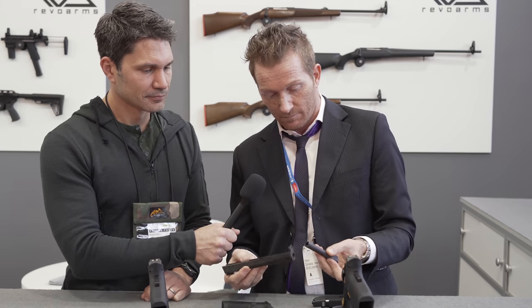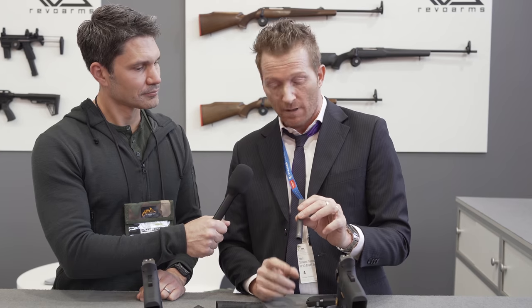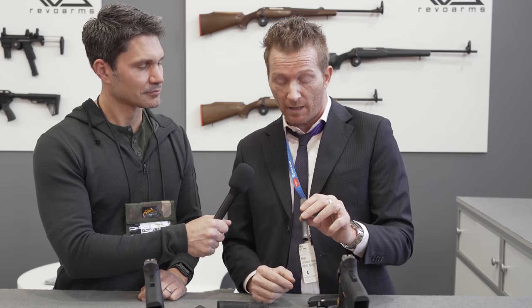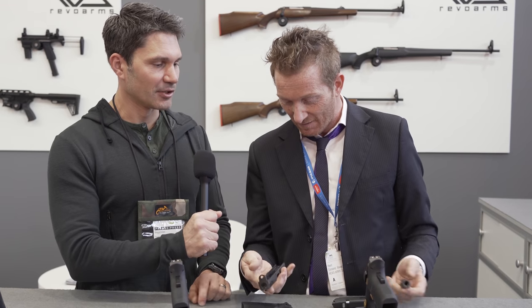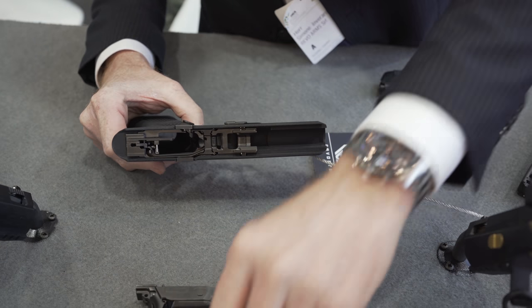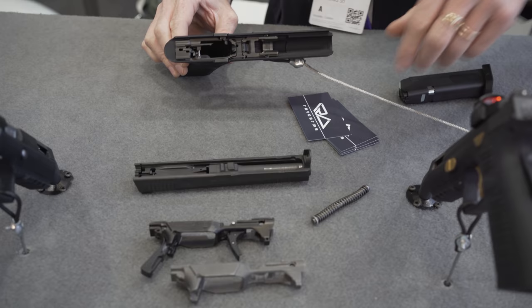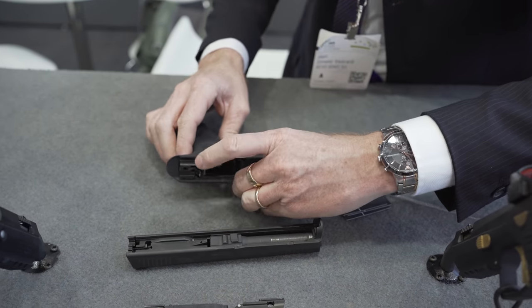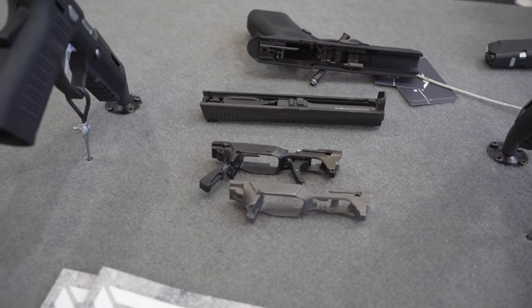You can see the barrel is very easy to produce. We use a multiradial barrel — it's a patented method for achieving very high velocity and for reducing recoil. You can see on the website what this is. The extractor is completely internal, so you don't have problems with dirt from the outside. And we use DLC treatment — diamond-like carbon — which at the moment is the best surface treatment available, for firearms too.